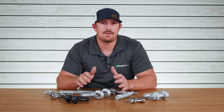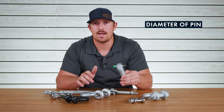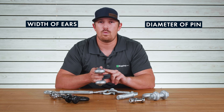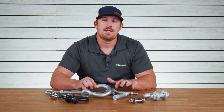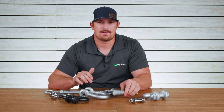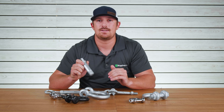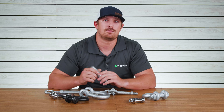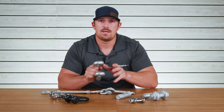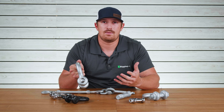The other two things to consider when selecting the right size shackle are the diameter of the shackle's pin and the width of the shackle's ear. Shackles are sized by the diameter of the bow, not by the diameter of the pin, so you want to double check what the pin diameter is going to be and make sure that pin can easily pass through the rigging fitting or attachment point. On the bow side, make sure the width of the ears can easily pass through so that the bow can be attached.